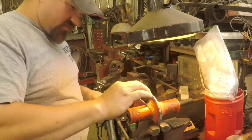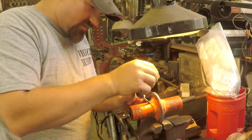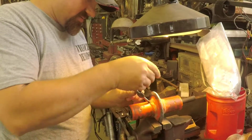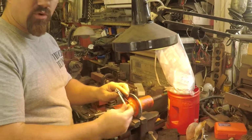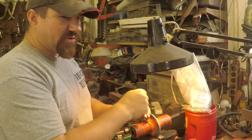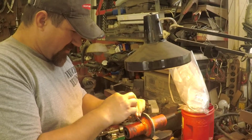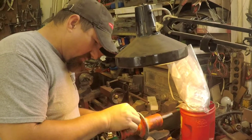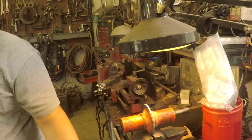So we're making threads. They seem to be through, and I haven't hit that rod yet. Of course, I should have plenty of thread in there for that. Now, the question here is I pulled that out of a metric pack that had 6 by 1mm on the pack, but there were several different grease zerks in there, some were chrome looking, that one is a little bit of a brass look to it, so something tells me they're not all the original ones in that packet. So I'm hoping this is the right one. If not, we'll find the one that does fit it. So I got threads there. Something that's bothering me is I've got a little nub sticking off there. I'm gonna try and do something with it. Just one moment here. I'll be right back.